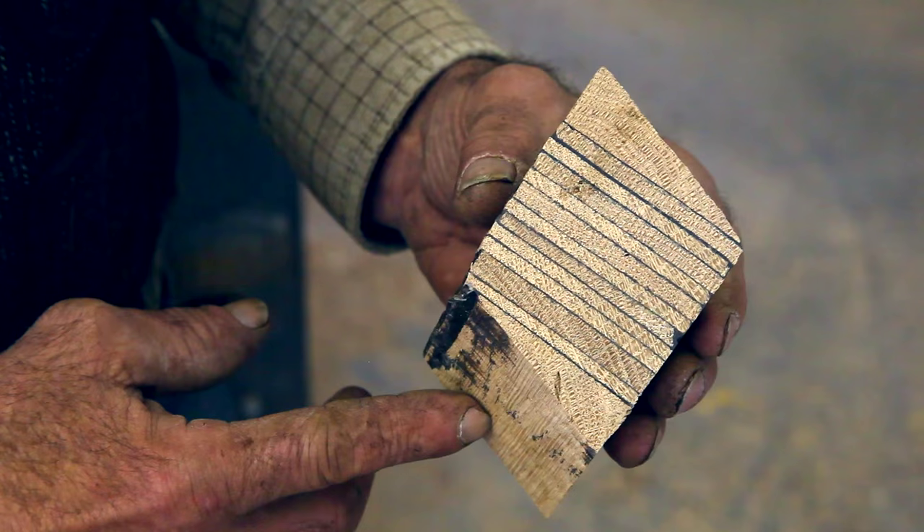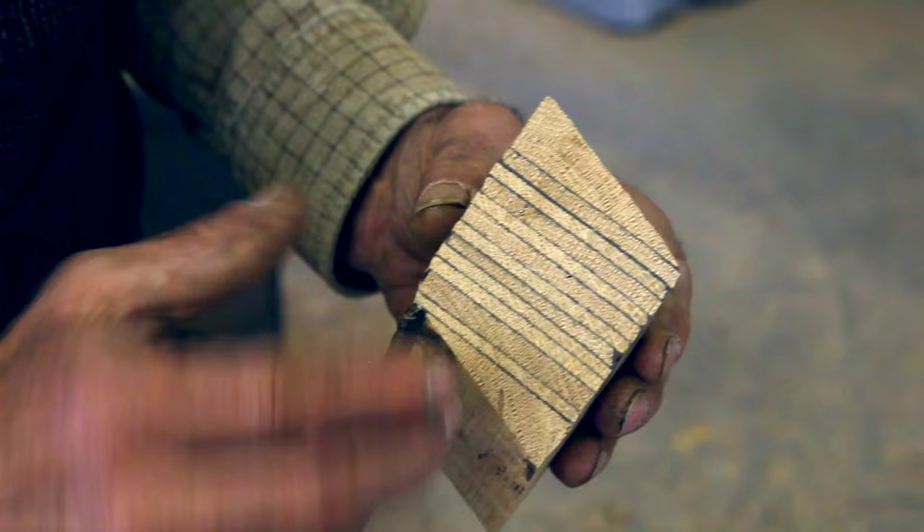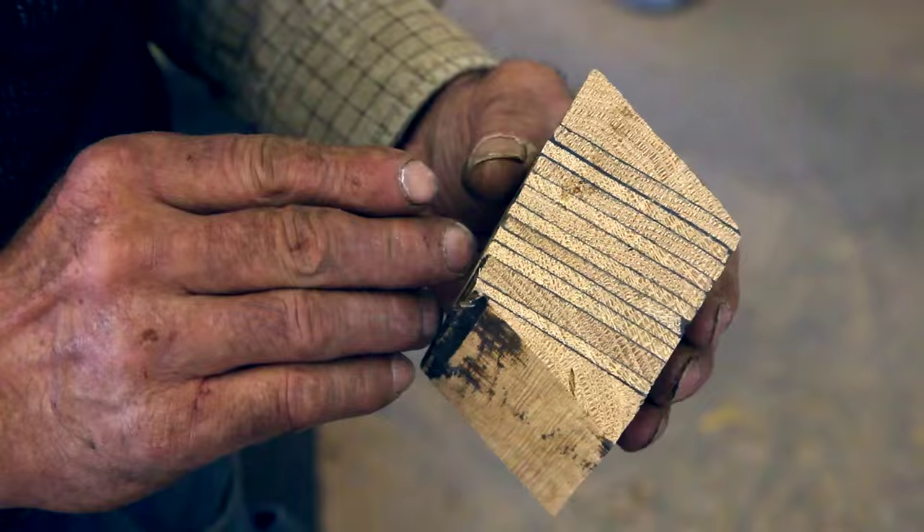This is the cut-off from the end of the frame — you can see the beveled laminates and a stack of laminates in between. We've taken a piece of this cut-off and put a wood chisel on the glue line and tried to split it apart on the glue line, and we can't do it. It's substrate failure when you try — it rips the material right apart. That's how good the glue is.